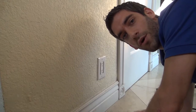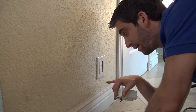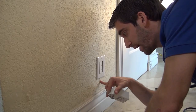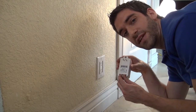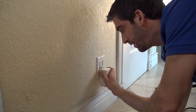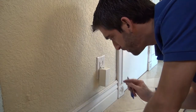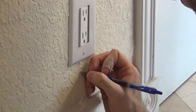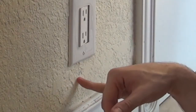Now that we've made our hole for the LT cable, we need to make a matching hole to fish the cable that's going to connect to the transformer. We have our two terminals on the back of the transformer. We're going to use this plug here for power for the L5100 — plug it in, note where the hole should be, and we're going to drill this hole.